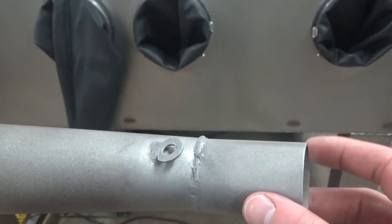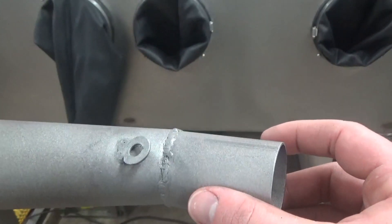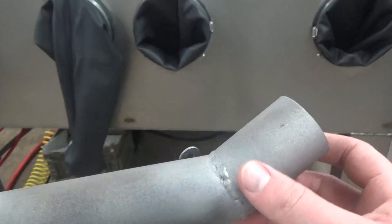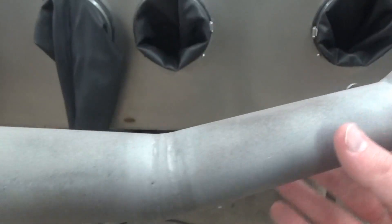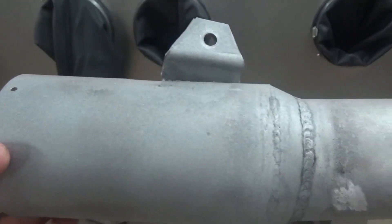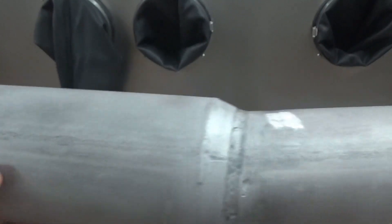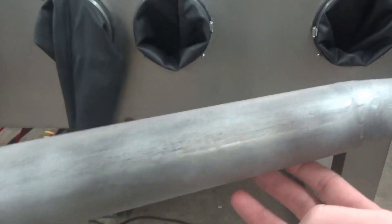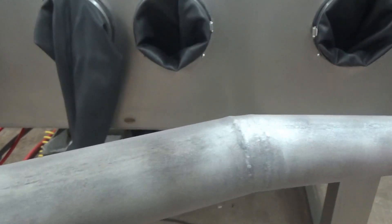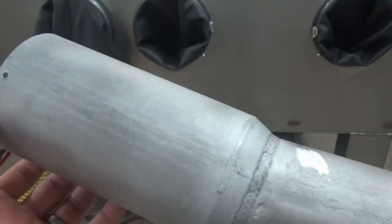This is probably a little bit rougher than you're going to want for these types of ceramic coatings. However, this is a set of exhausts for a race bike, so we're not looking for show-winning quality here. We were really concerned about ripping this coating off so that we have a good anchoring profile and good adhesion with no coatings to interfere. This is a very aggressive process with garnet — the most aggressive you're going to have in a wet blasting system — but it works very fast and very well for applications such as this.